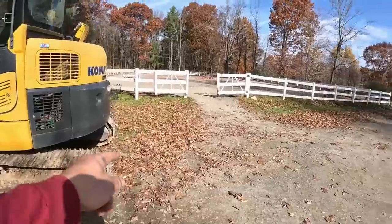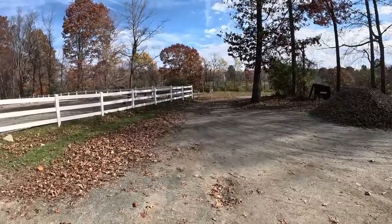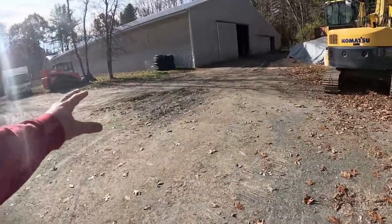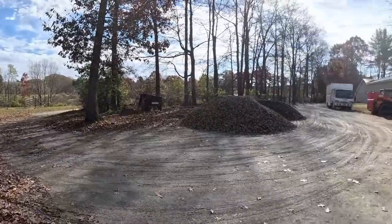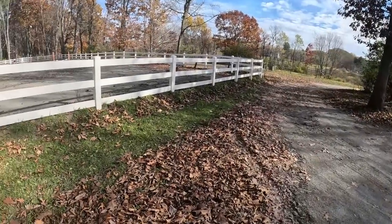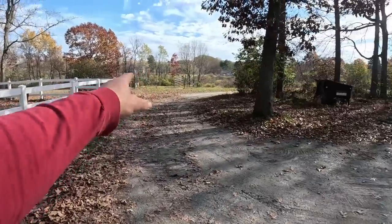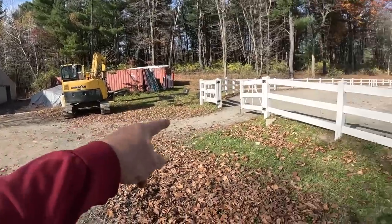We'll come straight across here and hug the grass line where no vehicles will be, so we don't have to worry about pipes getting crushed. This is mostly horse traffic, but right here there is some heavier stuff. We're going to backfill with crusher run under all the pipe and compact it so no horses get any sinking issues. It's all perforated pipe along the building, then solid pipe the other way.